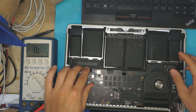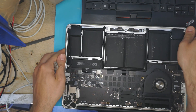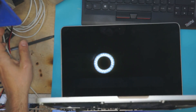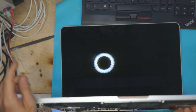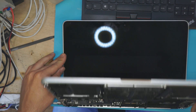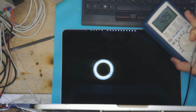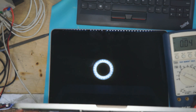So what I want to do is see if this machine has the capability of giving us a screen after undoing what happened at the Genius Bar. Let's plug it in and power it on. Okay, let's see if any smoke pops out of the connector — no smoke. Now we're going to see if we're getting five volts on the screen at that nasty section. Looks like we are. And now let's see what we're getting on backlight — 39 volts. And as you can see, we are now getting a question mark folder on the screen.